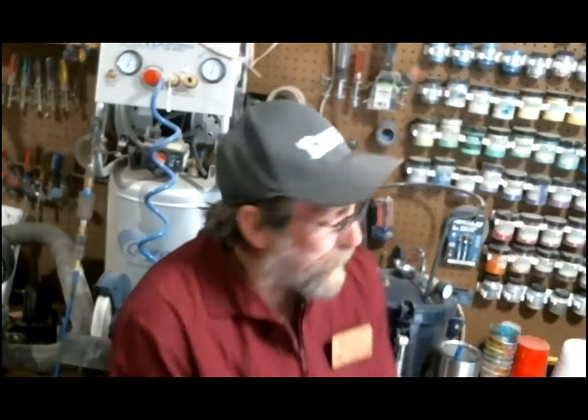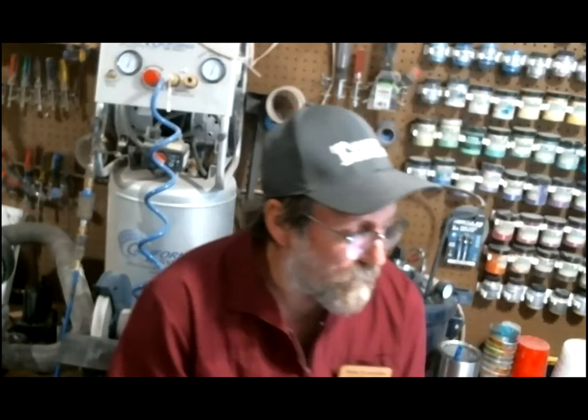So I can tell you about pressure pots a little bit, and we'll get into that. And we'll talk about stabilizing with vacuum with that. You can't use a vacuum chamber with this type of resin. Some epoxies don't set for 24 hours, so you can literally degas them in a vacuum chamber. Where this resin sets so quickly, there's no way to get the gas out of it in time in a vacuum chamber, so you have to use a pressure pot with it.